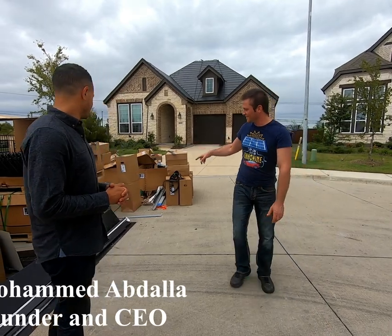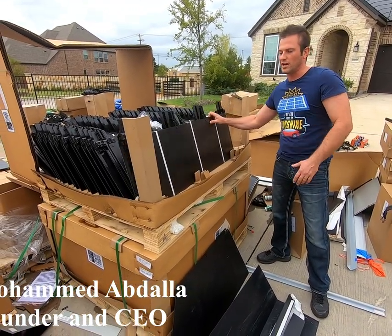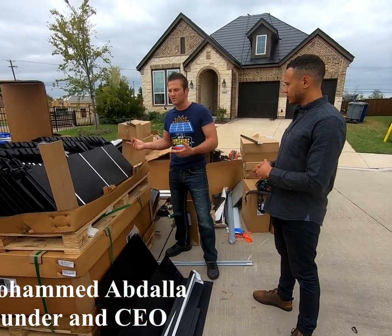And if there's a big storm, I don't have to replace my whole roof — they're designed for serviceability. You can use a little tile removing tool, pop up a glass tile, slide it out of its feet, slide a new one in, put it in its feet and push it down. That's your busted tile replaced versus every three or four years in North Texas replacing everything after a hailstorm. With traditional petroleum shingles you can't see where the damage to the plywood is underneath. You'll have a bad hailstorm and get a leak — but where's the damage? With these, you can just pop out one or two cracked tiles and you're good to go after two hours of work.